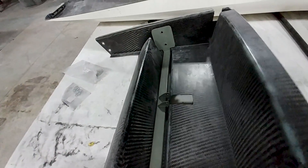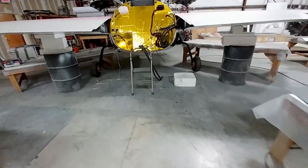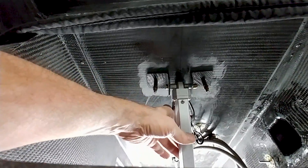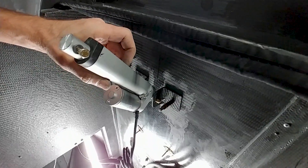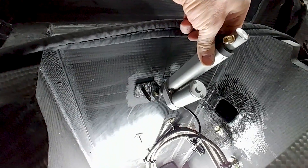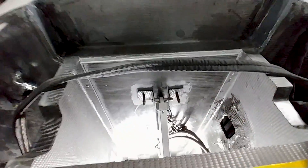Welcome back. Second half of the week there's all kinds of small jobs going on. This one is the intake tray and what I've been working on here is getting the linear actuator sorted out for opening and closing the intake scoop. This actuator ended up being slightly too long — it's a four-inch travel. I really had three inch in my CAD but I've decided to go with two inch because we don't really need the scoop to open that far, and initially we're actually going to bolt it down and only activate it if we really need extra cooling when we're doing taxi testing.